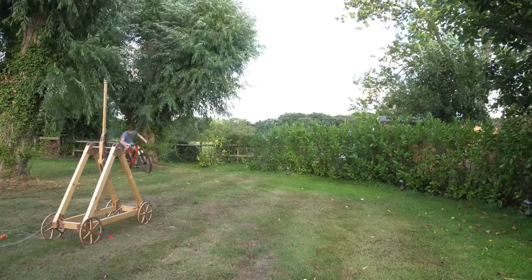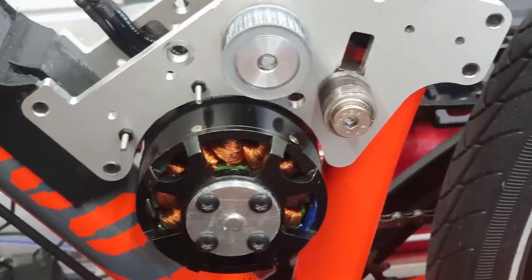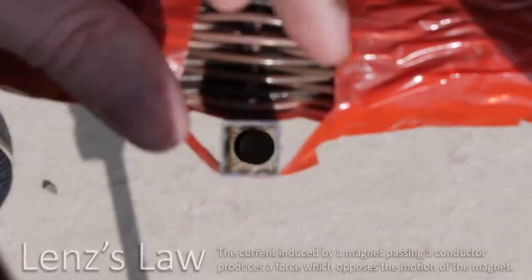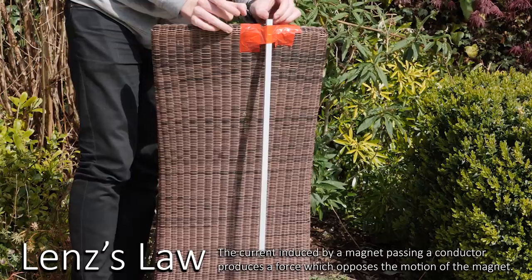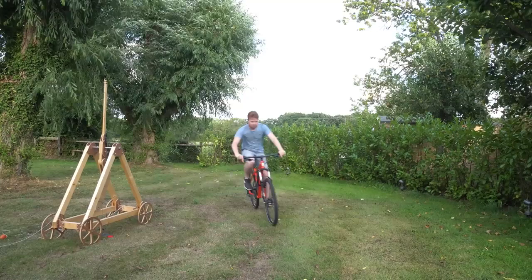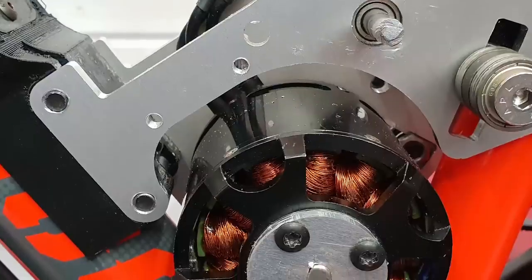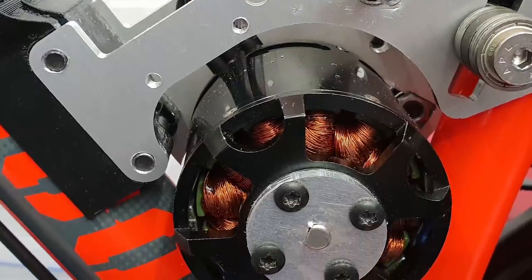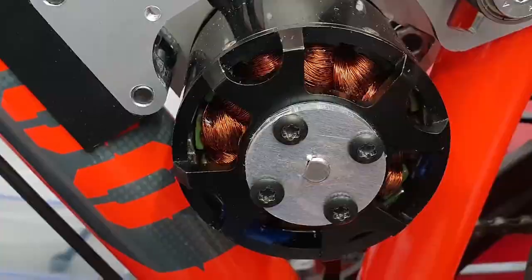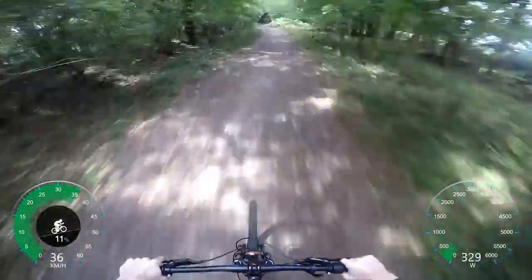Then I was having motor issues. Running the motor so close to the aluminium mount caused resistance — aluminium isn't magnetic, but a magnet dropped through an aluminium tube shows clear resistance via eddy currents. This caused so much resistance on the motor that it lost sync with the speed controller and briefly tried spinning the wrong way, causing the belt to skip. I widened the slot a little, and also made a plate to hold the shaft in place after my idea of cutting the end off caused it to slip. I then 3D-printed a cover for the motor and the bike was ready for a test ride.